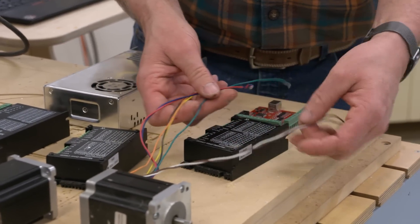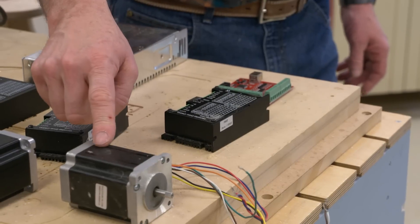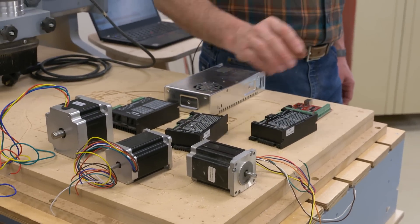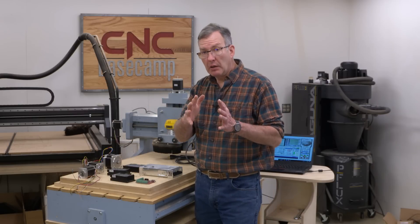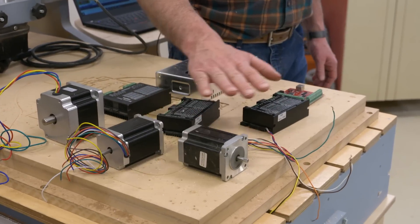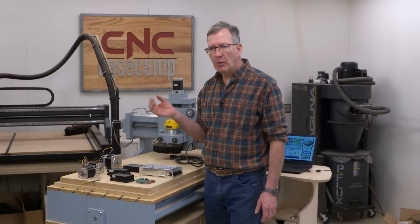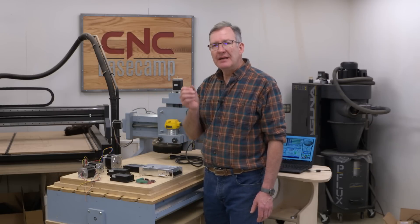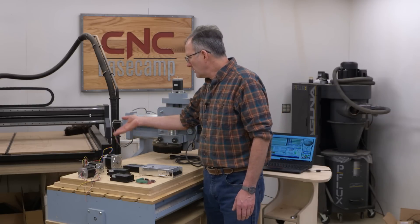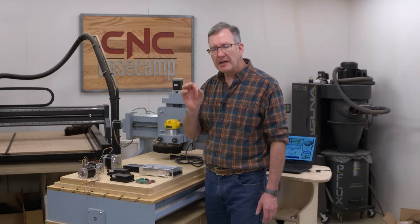For all these motors, the wires ended up being paired, so there were essentially four connections made to the motor. These motors have two coils — typically A-plus, A-minus, and B-plus, B-minus for your connections. A-plus and A-minus go to one coil; B-plus and B-minus go to the other. The cables connecting the motors to the drivers are high-duty cycle cables. For my machine, I simply have the cables looped loosely on the exterior, but the cables are meant to go through cycles millions of times.